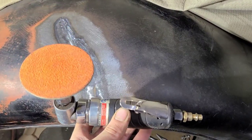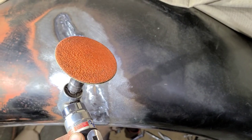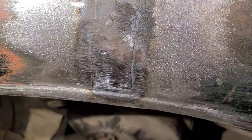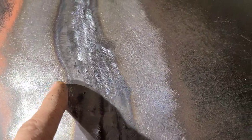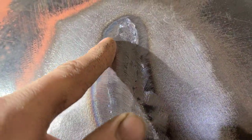I'm using this grinder with a 50-grit pad. All I'm doing is just going across very lightly, low RPM, just removing the weld. As soon as I start to touch metal, I stop - you don't want to go any further than that. You don't want to get it totally smooth right now. All we're doing is sanding off the top of the welds - when it touches metal, that's when we know we have to stop. The thing with this stuff is it always looks worse before it looks better. If you try getting it smooth right off the bat, you're just going to end up digging a hole in the metal and thinning it out.